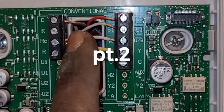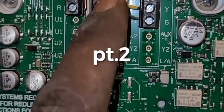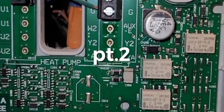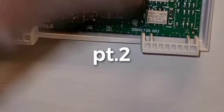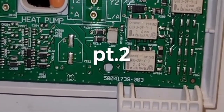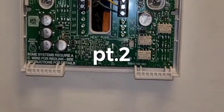Here's the thermostat. Here's my red from upstairs — I was getting my 24 volts, so it was coming here, but the thermostat wasn't passing it to my Y because my safeties were open. This thermostat has built-in safety features. I had a high-level float switch hooked up to S1 and S2 and it was open, so that wasn't going to let the unit function normally.